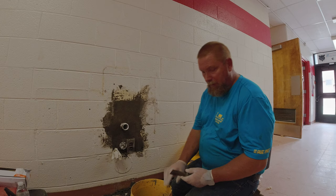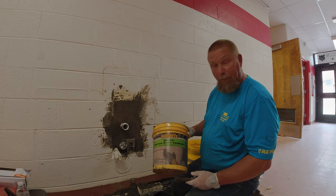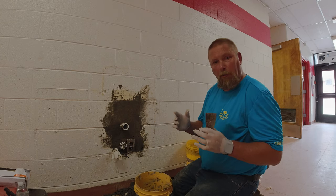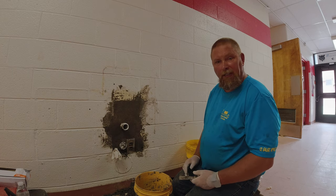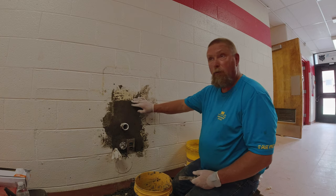That's what you get. We're using the Quikrete Hydraulic Water Stop Cement — very quick acting. Make sure you wear your rubber gloves, that's a key thing. It doesn't matter what your concrete looks like as long as you don't burn the heck out of your hands with that chemical burn. Basically we'll leave this to dry.